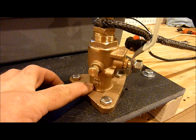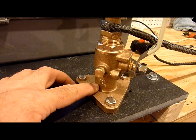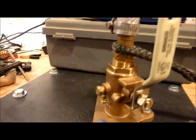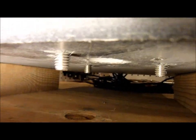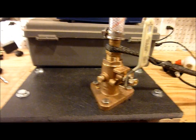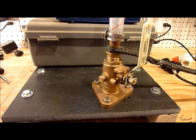I've also found one of the smallest, what I would consider perhaps the least robust UL Marine listed flange seacocks. I find the Apollo version a little bit thicker and more robust. We've got three 5/16 by 18 bolts drilled and tapped into the fiberglass. I purposely have not installed the through-hull fitting, which is an integral part of this — so this is kind of an unfair test, because when the through-hull fitting is inserted, it adds even more strength. Most of the strength actually comes from the through-hull fitting; the bolts are there as a secondary.